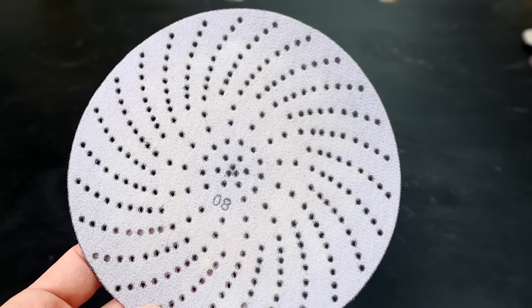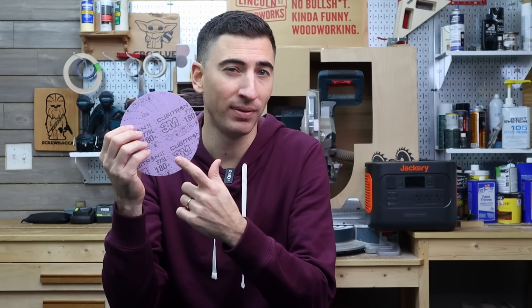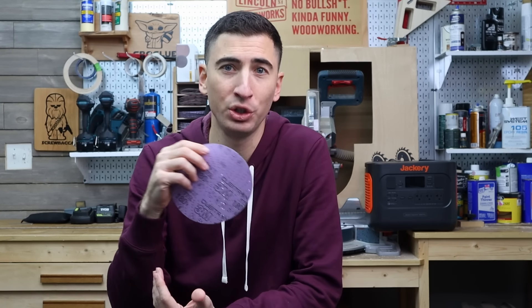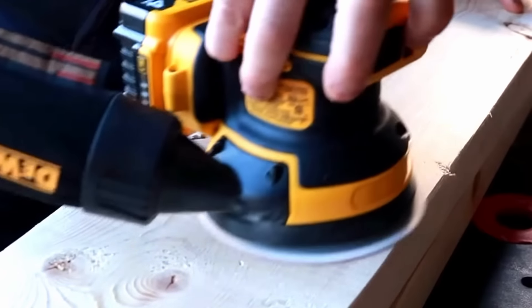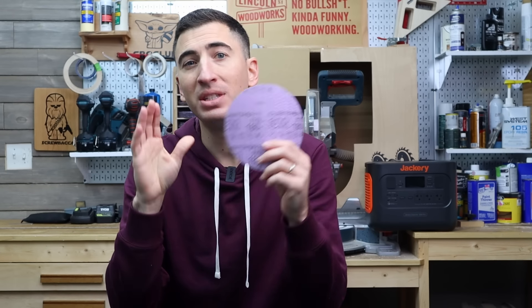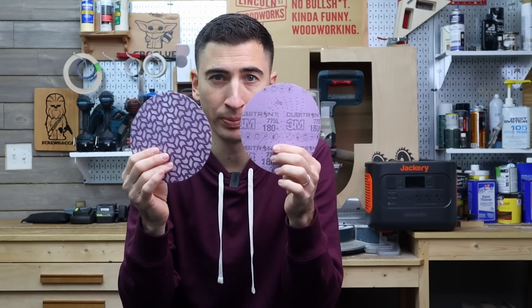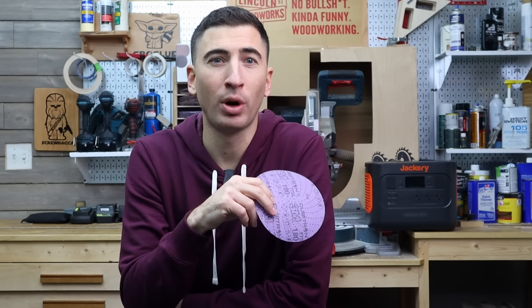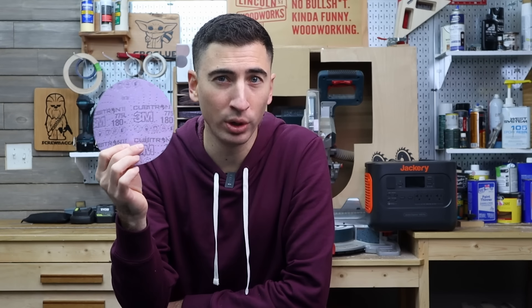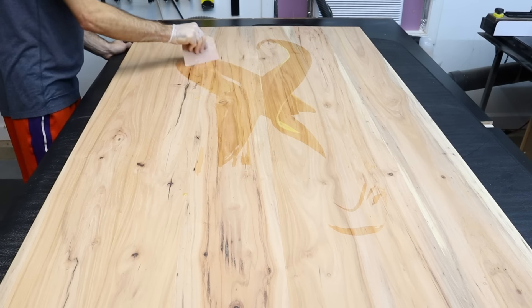Because of the laser-cut spiral hole design, you don't need to waste time lining up the pattern with your sander. Additionally, the backing and design allows you to use the 775L without a dust collector — but just because you can, doesn't mean you should. I would always advise hooking your tool up whenever possible, because this will extend the life of your sandpaper and give you faster, more consistent results. Now for the cons: this is the most expensive disc, combining excellent durability, cut quality, and dust collection, but you're going to pay a premium price. It costs 50% more than the 710W. It's not the best option if you work with resinous softwoods like pine, because those species cause a disc to clog up prematurely, requiring more frequent and costly changes. Finally, the 775L does have a stearic soap-based coating to help keep material from sticking to the disc — the only downside is that if you don't clean off your work surface after sanding, there is a potential for residue to be left behind and interfere with your finish.